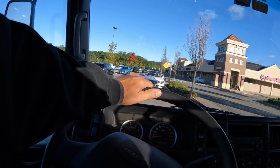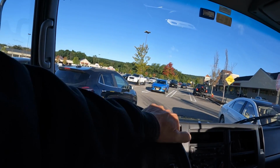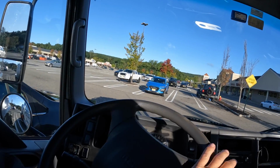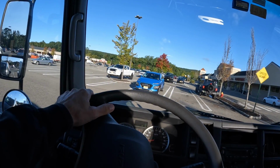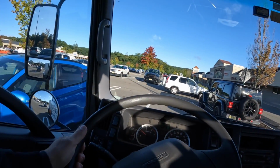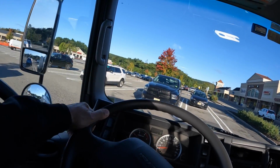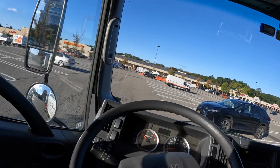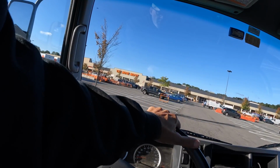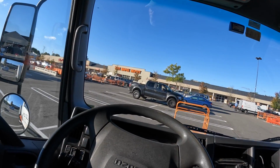Now, yesterday, I was telling you that we try to avoid the puddles as best we can. Now, on dry days, it's kind of the opposite. We encourage the water to be inside the hopper. It keeps the dust down. So we do have a spray tank on the truck as well, so we can turn our sprayers on. But if I can get the hopper damp inside, the materials inside kind of will stick to the bottom, including the dust. And that will keep stuff from blowing around.